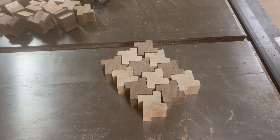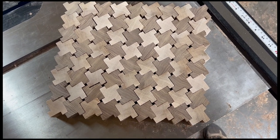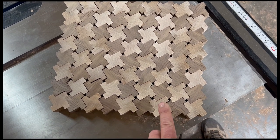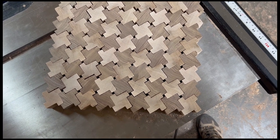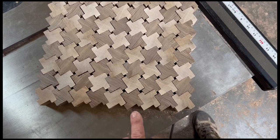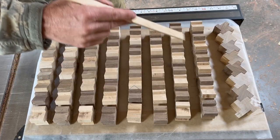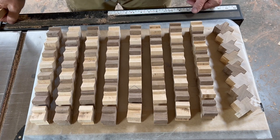After you get done cutting, put them all together to interlock — that's what it should look like. I alternated mine maple, black walnut, maple, black walnut. You could also do it row by row — a row of black walnut, a row of maple. These are all the rows from our puzzle cutting board.